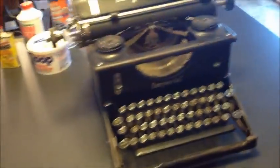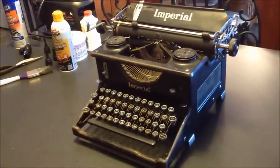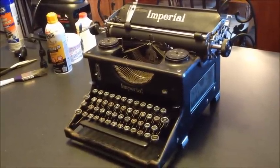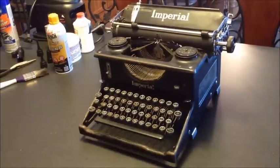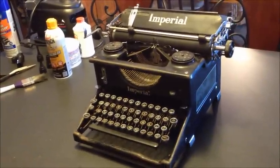You do want to get your typewriter to the point where you can actually get that compressed air in there to clean it. Most of the time you have to flip typewriters on their back, and it would be nice if they were all just like this. I don't know how many people out there recognize this thing. If anybody ever says to you, 'I got an old typewriter with glass windows in the sides,' you say, 'Oh, it's got to be a Royal.' Well, not necessarily. Here's an Imperial Number 50, pre-war. This is the first design of Imperial typewriter that was a conventional machine — first came out in 1927. This one's 1939, and it has some pretty interesting features.